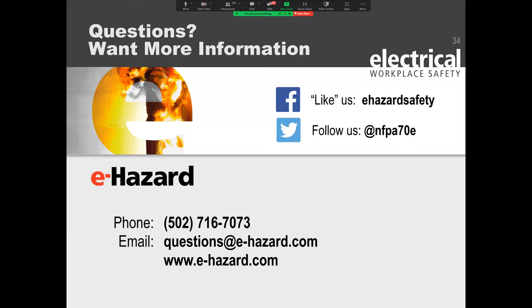You know, my thoughts are that that's most likely going to be a separate standard. There may be some references to that standard, but if you look at what they've done with Annex S, NFPA 70E cannot tell you thou shall go and use NFPA 70B for your maintenance requirements. They cannot tell you that because there's a NETA maintenance and testing standard. There's UL maintenance standards. There's the NFPA 70B standards. There's IEEE standards for maintenance. So it couldn't tell you which standard to use.